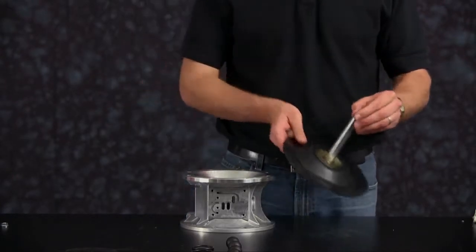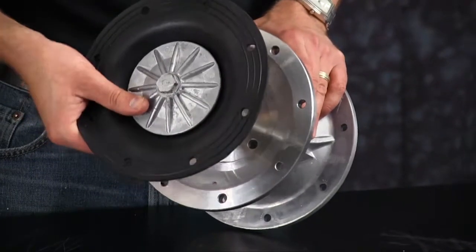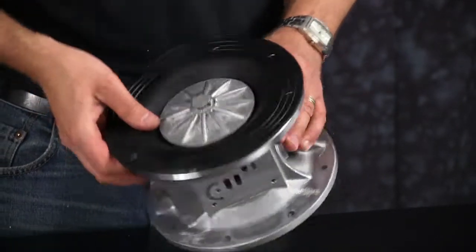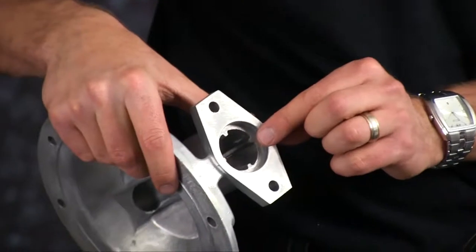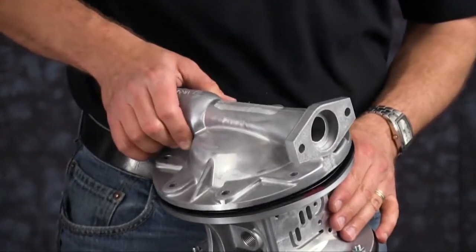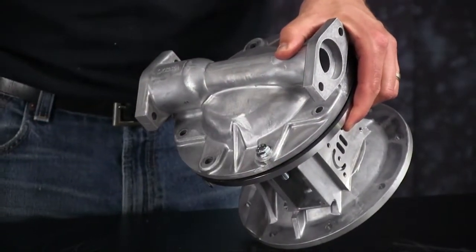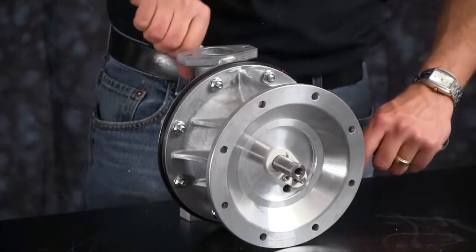Now we can install grease on the diaphragm rod to prevent the items from catching, binding, or cutting the mainshaft o-ring. Position the diaphragm so it lines up with all the bolt holes. Inspect the outer chamber for casting integrity — inspect the machine surfaces and radius of the chamber for damage or material buildup. Scarring, scratching, or material buildup can be cleaned up using emery paper, crocus cloth, or fine sandpaper. Chamber orientation requires the discharge side of the chamber to be installed in the same direction as the air valve face on the center block. Once the bolt holes are aligned, begin to install our outer chamber bolts. Tighten bolts evenly in a crossing pattern and torque to the recommendations called out in the service and operating manual.